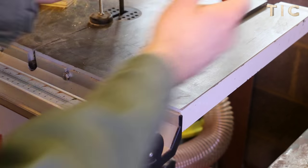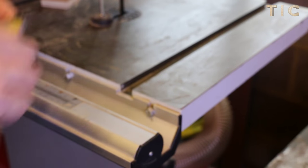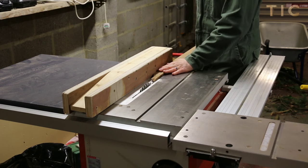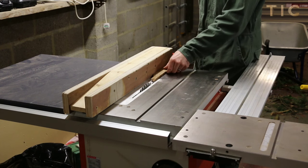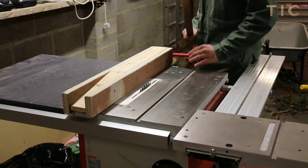I've got just over 18mm wide mitre slot, so I'll cut down a piece of wood to fit that on my table saw. To begin with I'm just going to clean an edge up by taking maybe half a millimetre off it, and then I'll set this to the 18mm I need and run it through again.